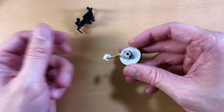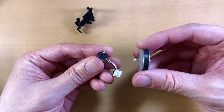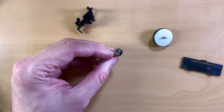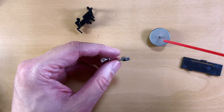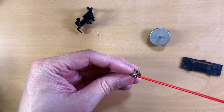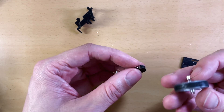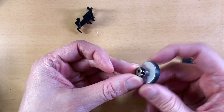If you're having these problems, it's most likely a mechanical encoder. The problem is that the contacts aren't making proper contact. If you're lazy, you could just try to get some contact cleaner, spray it in the crevices, and then work the scroll wheel back and forth. This is what people do to fix sliders and potentiometers as well. If you're lucky, this could fix it — I did this first and it did get better for a day or two, but then it started acting up again.